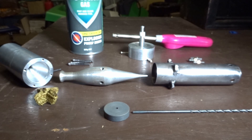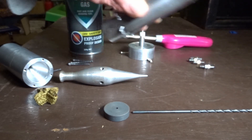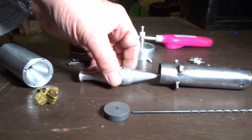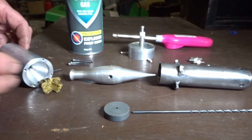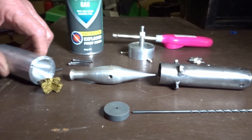A hybrid engine would basically be running into a ramjet. So this is your inlet tube with a ramjet. This is only the smallest — this is the first attempt at making one. This is the ramjet tube that goes inside. That's the diffuser. This is my attempted diffuser, and this is my converging diverging nozzle on the end.